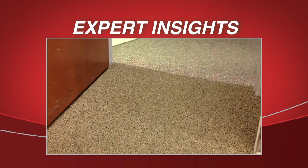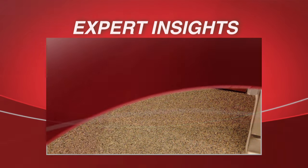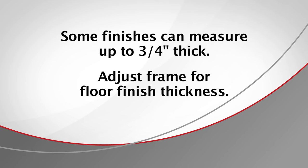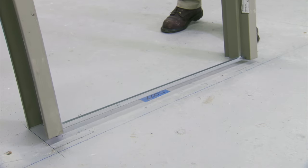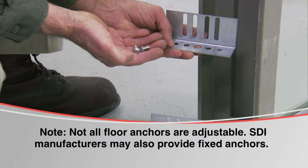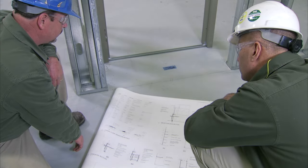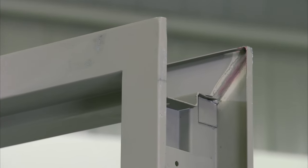Adjust the frame properly to the floor conditions so that the doors will not drag the floor when installation is complete. Some wood and tile finishes such as quarry are up to three-quarters inch thick; frames may need to be adjusted off the subfloor for different thickness floor coverings. In this application there are no additional floor coverings and no frame adjustment is required. Frames are provided with adjustable base anchors that allow you to adapt for floor surfaces up to one and three-eighths inches. Contact your job supervisor for verification of finished flooring.